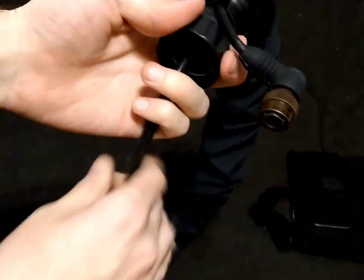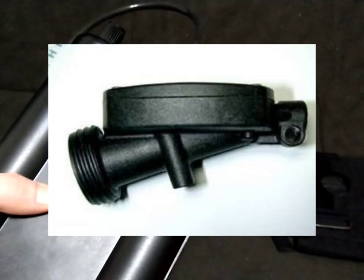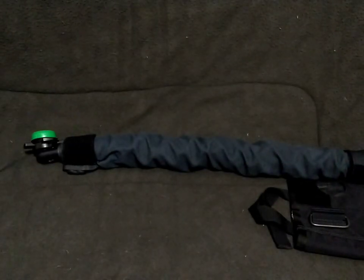There's also this long tube, which I called a tube cannula in the previous review — this is actually part of the SCBA regulator. The Avon ones, as far as I know, are the only blowers that have this. The Safety Tech and Draeger iPAPRs do not have it because Safety Tech's SCBA designation has their own regulator which does not need this tube. Avon's design was more compact, with the caveat that they routed that long tube up the hose for whatever reason.